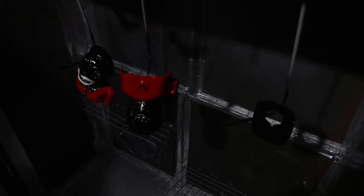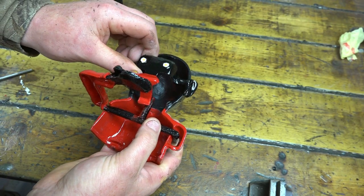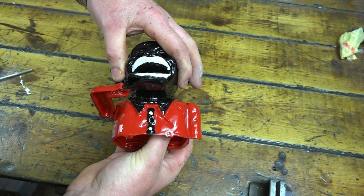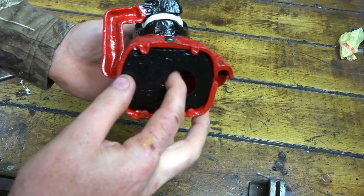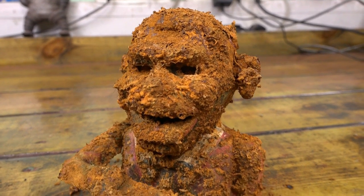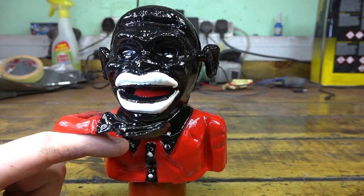So I've put them in the powder coat oven and I'm going to leave them in there overnight. I put a clear coat over them and then I'm going to give them 24 hours to dry - then tomorrow we'll put it all back together. I left them in the powder coat oven for about 24 hours, maybe just a little bit more. I'm just going to reassemble it and hopefully you'll like the outcome - it certainly looks a little bit better anyway. This is the metal base - I've actually got a new rubber piece to block the hole. Put the screw back in and there you go - there it is before, pretty rusty, and here it is after.